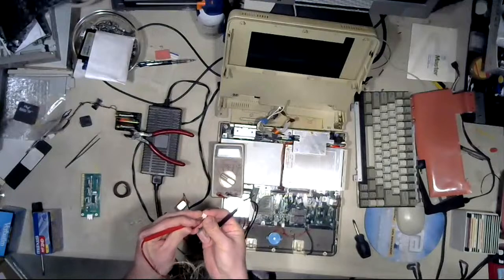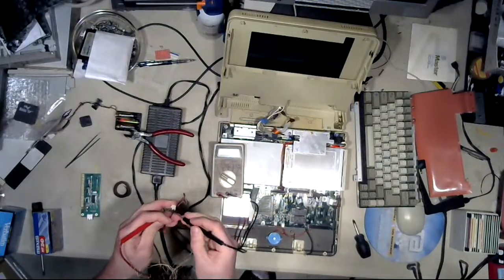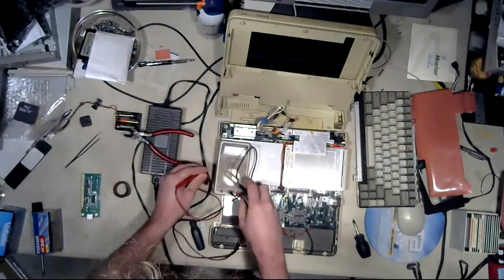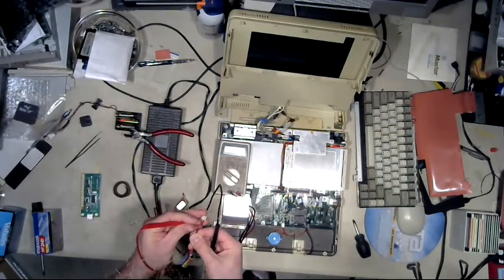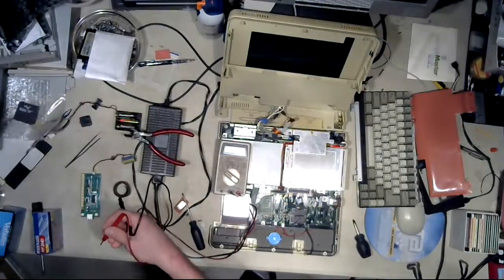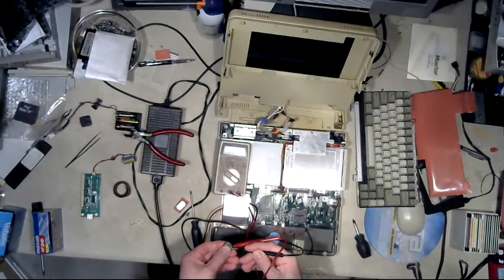Okay, so I have diodes. Thing is, this requires 3.6 volts. I'm going to connect it right here. Okay, let's try that. The diode will drop 0.7, so I'll get 2.3 volts where it's asking for 3 volts. I'm going to lose a volt. Interestingly enough, yeah, so this is 2.79.